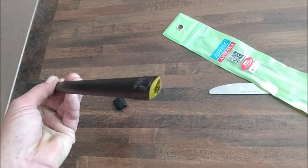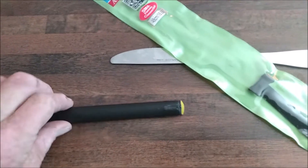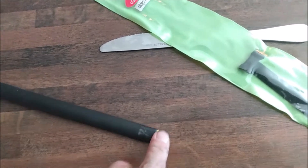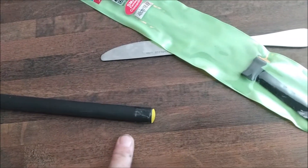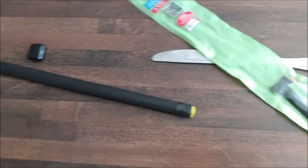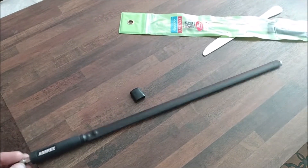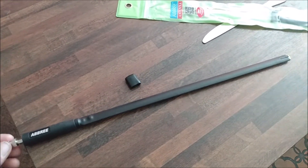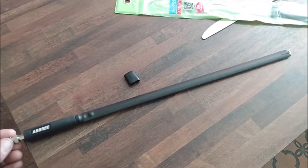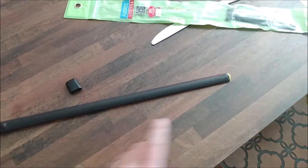What I'm going to do with this is stick a piece of metal in there and make it telescopic, so you can pull it in and out. I might cut it down a little and add a telescopic strip of metal — might be copper. I'll make a second video and show how it comes in and out of the center so you can adjust the bandwidth. We'll throw it on the Nano VNA and see if we can improve this antenna.